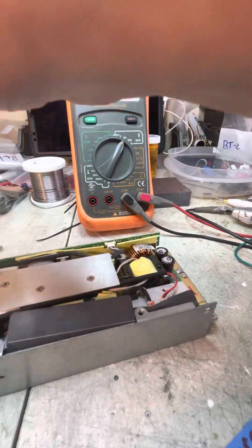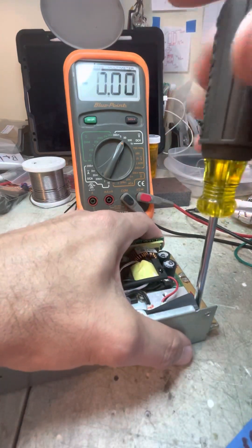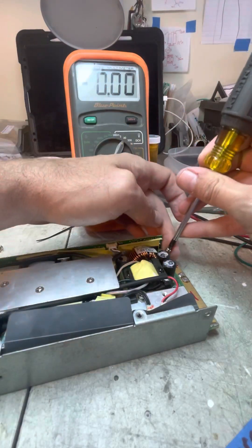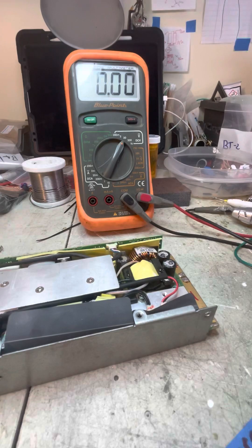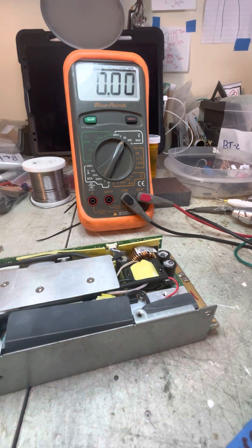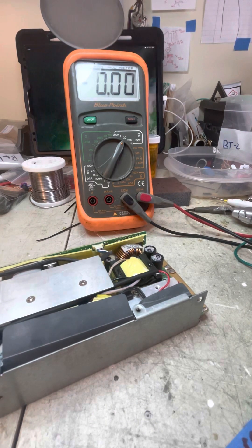On the OVP protection — when you modify it you're affecting the overvolt and undervolt, including current protection. When you pull too much current and the supply dips below a set voltage it shuts down. This one has a 5.1k resistor. If you wanted a lower range, say 13.5 to 14.5 volts, use a 6.2k on the overvolt protection board — that changes the factor and lets you set the voltage lower. I'll show you which resistors to use for that too.